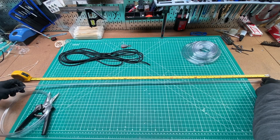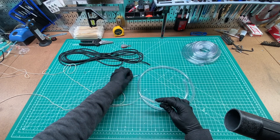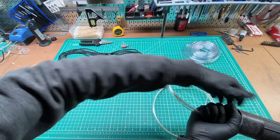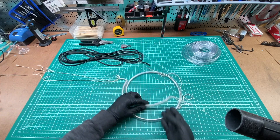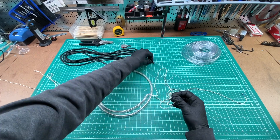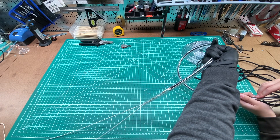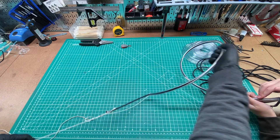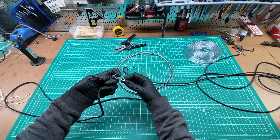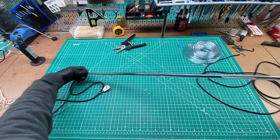Let's cut the larger 3/8 inch inner diameter tube to 39 inches. This will be a little snug for the double-backed rope. To get the rope in there, I'm using two lengths of small diameter string that I will suck into the tubing with my shop vac — a cool trick that also works for pulling string through electrical conduit. Now with two strings through the tube, I'm tying a slipknot in one to attach to the end of my rope. A slipknot is important because it bites into the rope harder when pulled, which is why I wanted that small lip on the rope end. Now I can use that string to pull the rope into the tube, then slide on the pulley and use the remaining string to pull the rope back through.